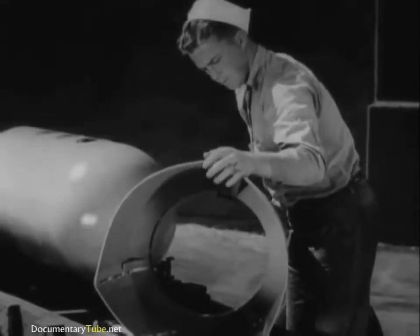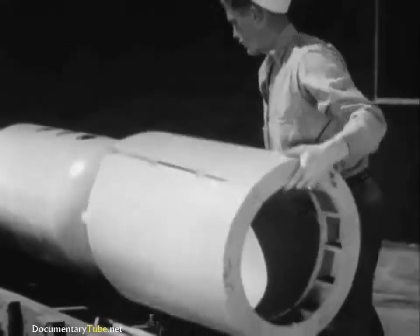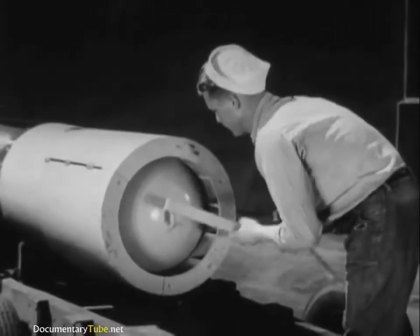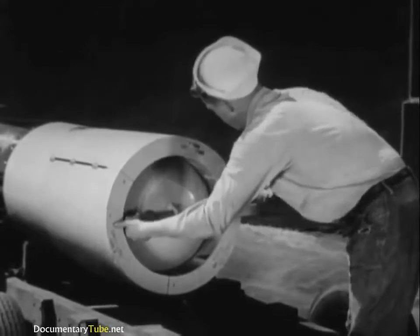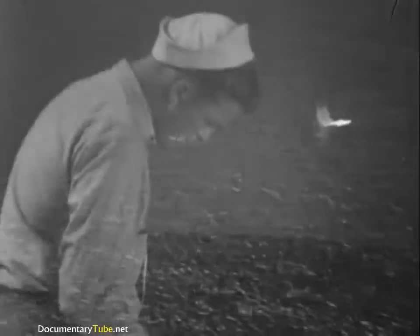The drag ring has two primary functions: to aid in air stabilization and to decrease the impact shock about 40% on hitting the water. This is especially useful in cases of extremely high altitude drops. In a torpedo drop, any deviation from true air trajectory is liable to cause damage on impact. The drag ring helps to eliminate pitch and yaw. Like the stabilizer, this disintegrates when it hits the water.